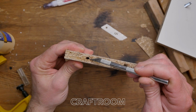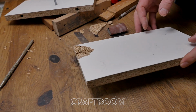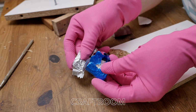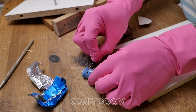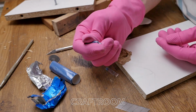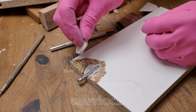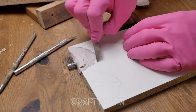It's time to restore the furniture screw coupler hole. For the second method, we will need epoxy clay. It can be in the form of two separate packages with resin and hardener, or in the form of such a sausage. Cut a circle from the sausage, remove the protective film and knead for a long enough time for better mixing. Fill everything with resin while embedding the furniture screw coupler there. Well, then we form a patch so that it doesn't look so scary.